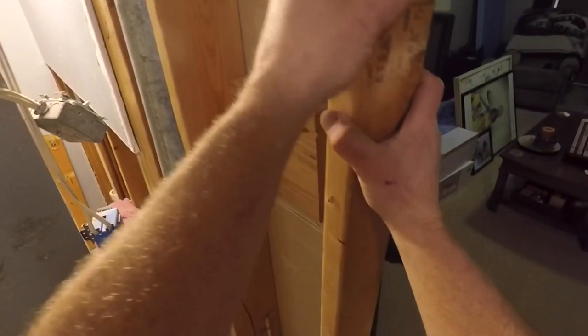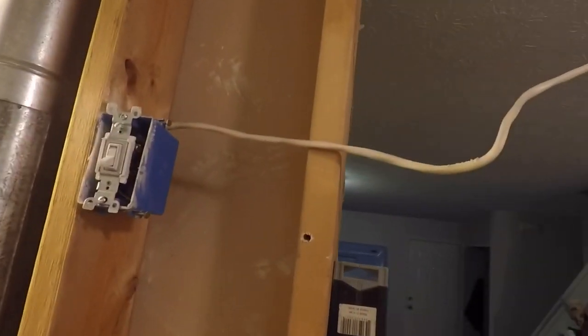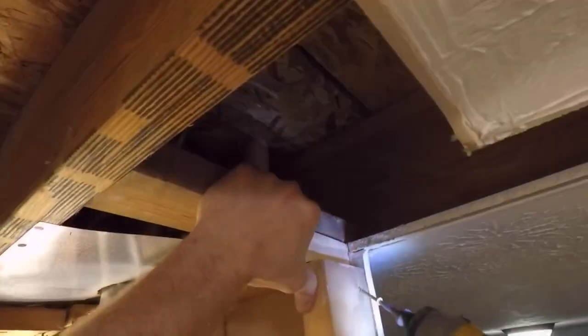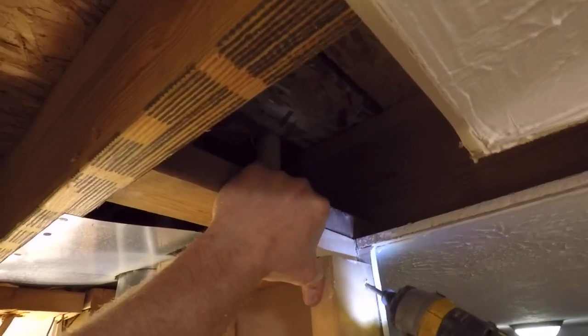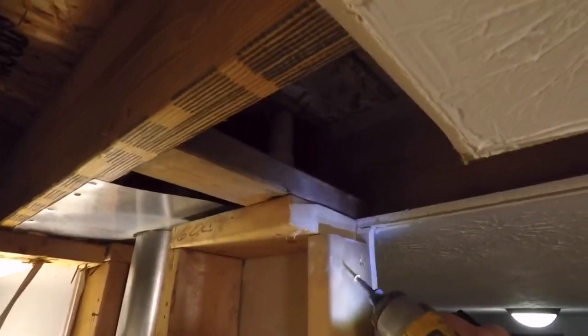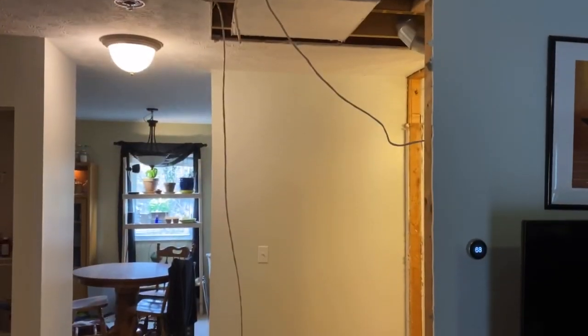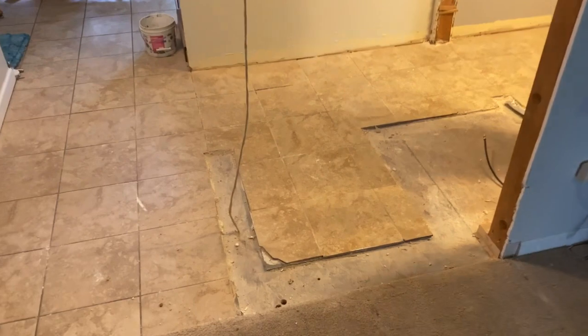And next I'm going to bring a 2x4, make my corner so it lines right up with the drywall. Should be level now. I'll check it and then start screwing it into the top. Just toenail a couple construction screws in here. If you've got a nailer, that would work just as well. Sometimes you use a nailer. This time I have some screws with me, so I'm going to use the screws for this job.